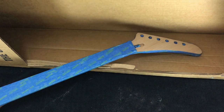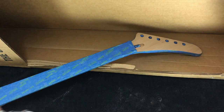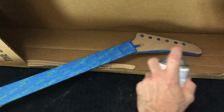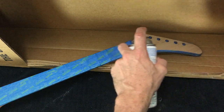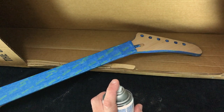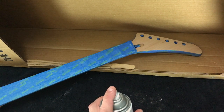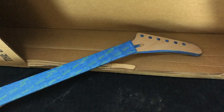I'm using an acrylic enamel primer — this is Rustoleum 2X. Once you hear the rattle of the ball, shake it up for a minute. When spraying primer, it's important to have the can on an angle and work in strips from the top, working your way down with each run overlapping by about 50%. I'll be doing two coats, so it doesn't matter if the first coat doesn't get full coverage — the second coat will adhere nicely to the first. It's also important to do your coats while the previous coat is still a little tacky so it adheres nicely; do one coat, wait about five to ten minutes, then follow with the second coat.